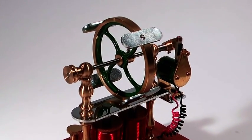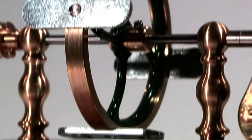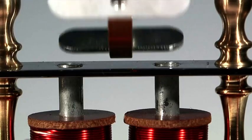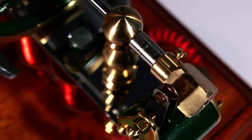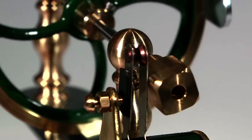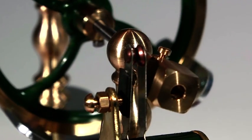In this example, four armature blades are arranged on a flywheel and directly above an electromagnet. As the armature blades approach the magnet, a cam-operated switching system energises the magnets, pulling the armature around. As the blade becomes level with the magnet, the power is switched off and the flywheel continues to turn, bringing the next blade around and so on.